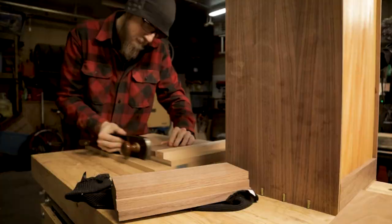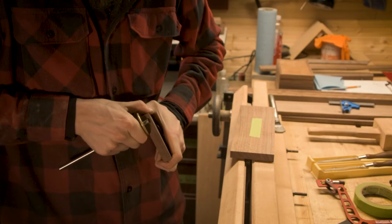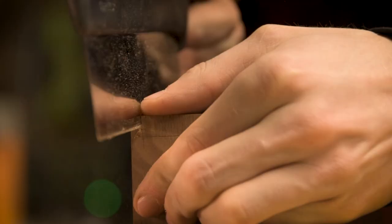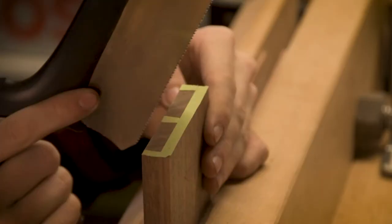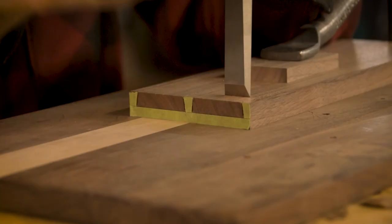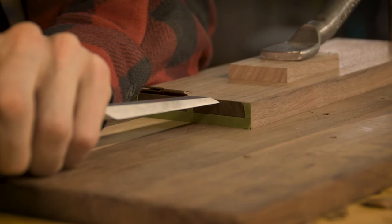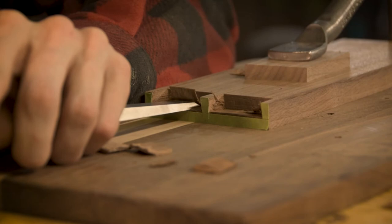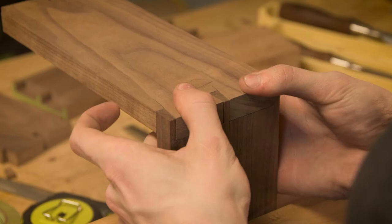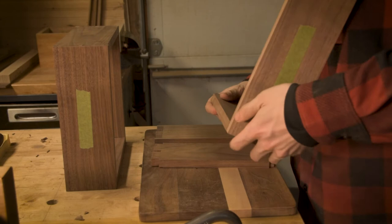Then it came time to do the drawer fronts. This is probably the part I was most afraid of, because getting a nice piston fit on the drawer fronts is such a complex thing to do. I really took a lot of time to focus on cutting the dovetails nice and true. On the front of the drawers I did half-blind dovetails. Now this is my first time successfully doing half-blind dovetails - every other time I've tried to do them I've always blown out the front edge. So again, focusing on what I was doing here, working with very sharp tools, and just trying my best to not have any issues. I got very lucky - I can chalk it up to a little bit of skill but mostly luck. On the back of the drawers, because there's nothing super complex or visible, I just went with through dovetails to make it a little bit easier. I'm super glad that I did do half-blind dovetails because it was such good practice for projects I will be doing in the future.